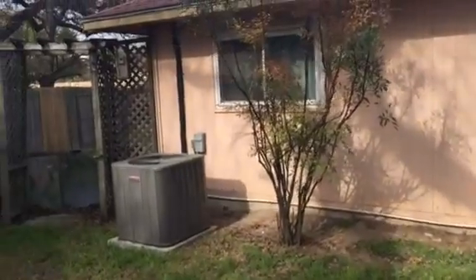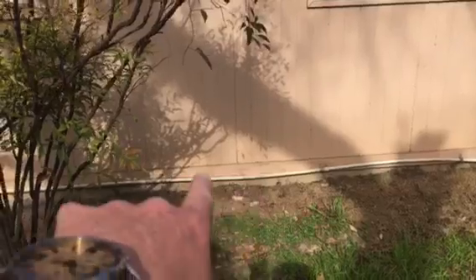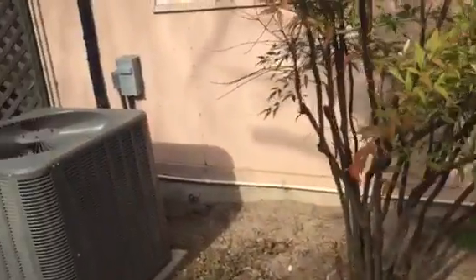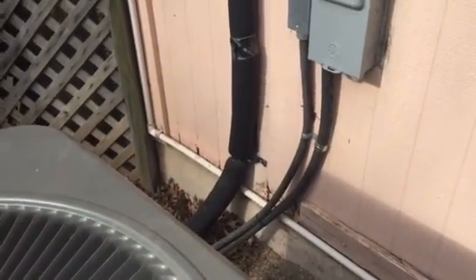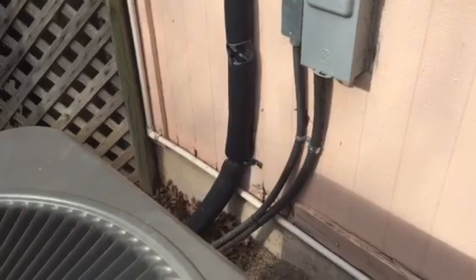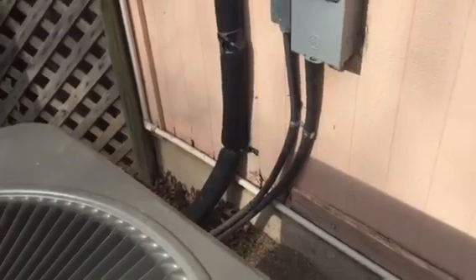It is a full tear-off and there are a couple of areas. You can see — like most houses — they put on this horizontal board to hide and cover up any rot because it's just Masonite. There's a little rot right here, so we just got to pull that off. The whole siding is coming off anyways, but we just need to make sure we inspect the base plate there to make sure there's no rot or anything.